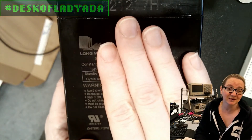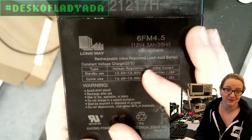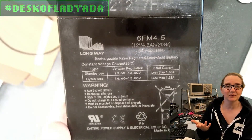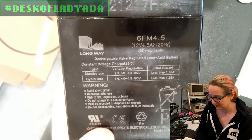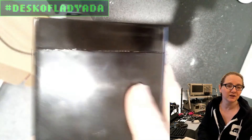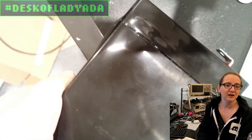Better yet, if you have one of these, don't use the charger if it's 24 volt - use a 12-volt charger. It's not like it saves any money for them to give you a 24-volt charger. I think it was just a cock-up. So we need to get a new one of these because these are sealed - I'm not going to pop it open and fix it.